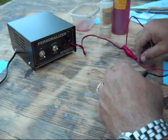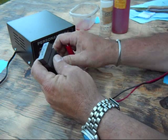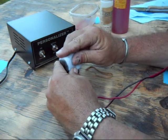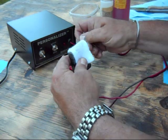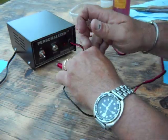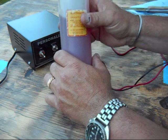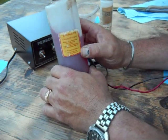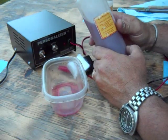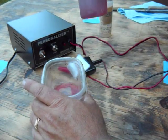Attached to that is a lead and a carbon brush. The lead will clamp to the knife. The carbon brush — you take a cotton pad, put it around it, and hold it in place with just a rubber band. You've also got electrolyte; this is a general purpose electrolyte. I've got some poured out in this little dish. There are a lot of them on the market — salt water even works. This one came with the machine.